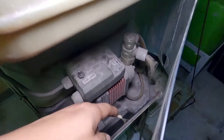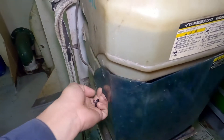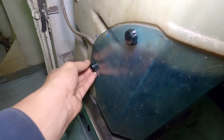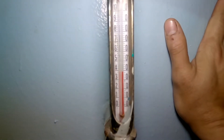This is the chemical dosing pump. This is also secured since it has no use if the evaporator is secured. Once it goes off, secure the remaining sea water valve and you're done.